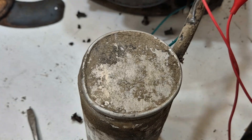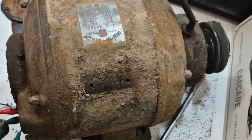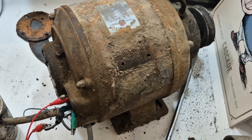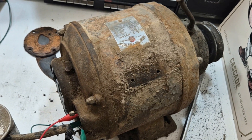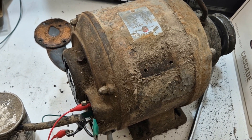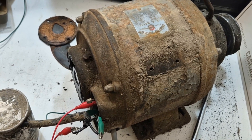You can measure these like a normal electrolytic capacitor - they should measure very similar using an ESR meter. Interestingly, my neighbour's motor wouldn't run at all. With these things, if they're just sitting there humming you can actually give them a spin - if you're very careful, use a bit of wood - and usually that'll get them going. But his one would not go. Once I measured it, it was reading high and then a little bit of smoke came out of the capacitor to prove it beyond all doubt. We pinched one off another motor and that got the machine going. His other machine - some sort of woodworking machinery - had a dud capacitor too, turned out to be exactly the same capacitor. When we opened up the end you could see the rust, and it just all fell to bits - tore off the terminals. She was well and truly shot.